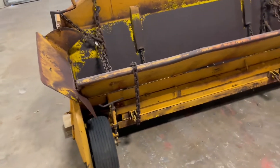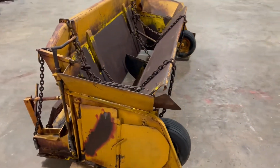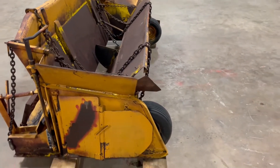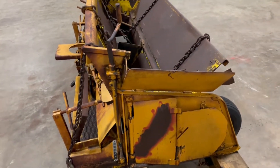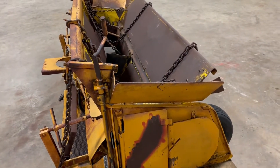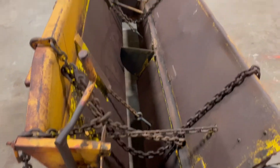You can evenly spread on the outside corners of the road. Pretty nice little unit right here. You can drop it down — it does have the rubber wheels so you can roll it on the back side. You just hook it to the back of your dump truck and you let it dump into this system right here. It goes along and spreads that rock very evenly. You can close your tail as you need to, you can open your tail as you need to. It's got all the pieces there.